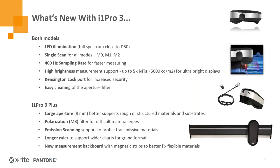There's lots of new stuff with the i1 Pro 3s. LED illumination — a full spectrum LED cocktail versus the tungsten bulb used in the i1 Pro 2 — allows for single scanning in all modes, so you can capture M1, M2, and M0 measurements all in one scan without having to do separate scans for visible and UV. We doubled the sampling rate, giving you twice as many samples per second. We've enabled the devices to measure high brightness displays, supporting up to 5,000 nits. We added a Kensington lock port so you can lock the device down to a specific RIP or location in your workflow. We also made them easy to clean, which was a pain point with the original i1s and i1 Pro 2s.